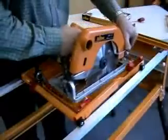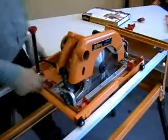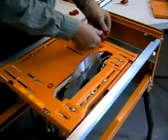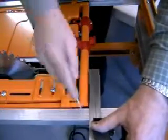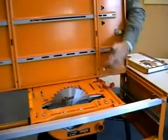Now fit the chassis to the Workcentre and refit the saw and guard. Flip the chassis over and fit the red chassis hook, which is essential for ensuring the chassis does not move during a cut. Mark the aluminium rails for ease of relocating the chassis in exactly the right position after ensuring that the chassis hook is well located on the W channel.